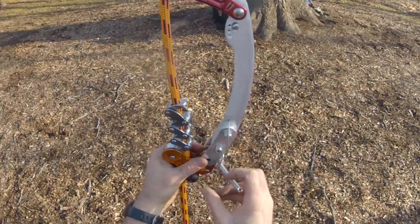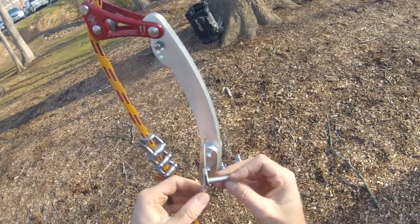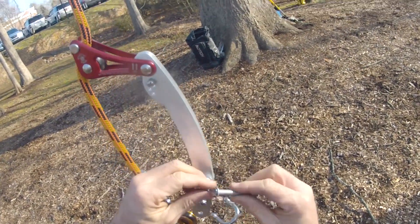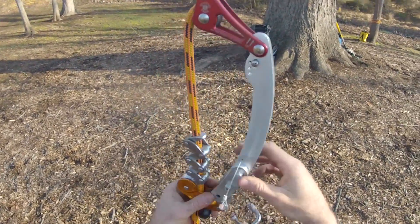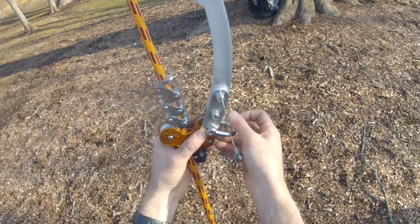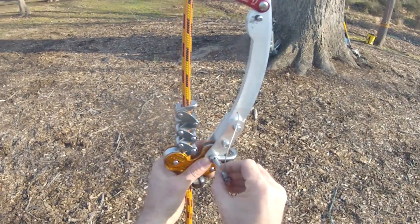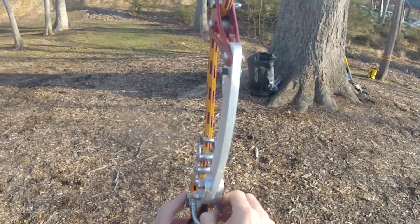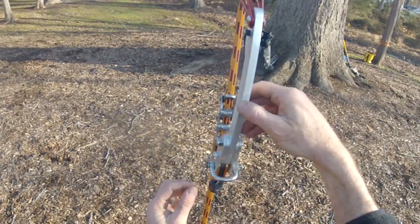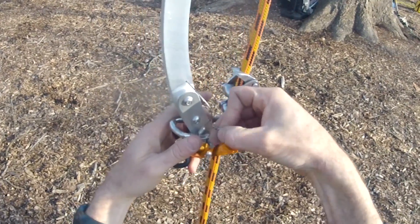The tether connects to the zigzag using a stainless steel D-shackle that doubles as a convenient attachment point for a neck tether. All the parts of the D-shackle attachment point are connected via a stainless steel wire rope lanyard so they can't be lost when the tether is detached. These parts consist of a stainless steel 5/16 inch clevis pin, the D-shackle itself, and a lockable round cotter pin which is also made of stainless steel.